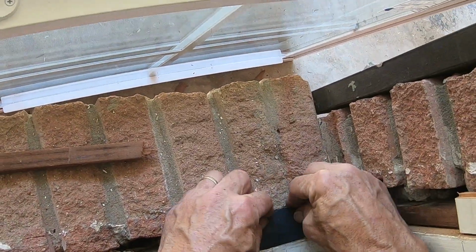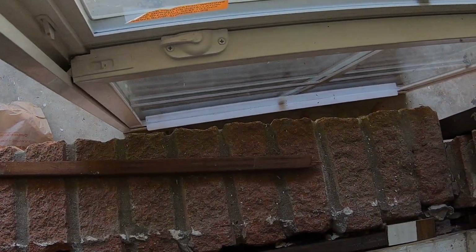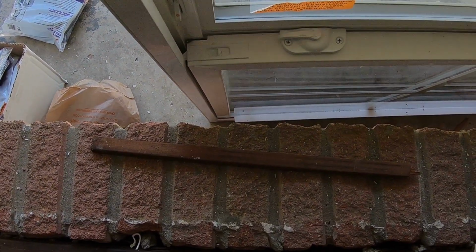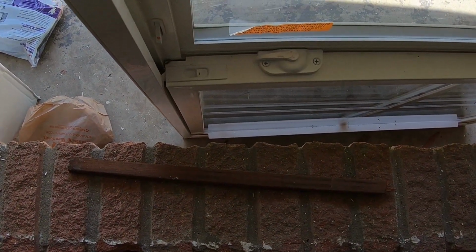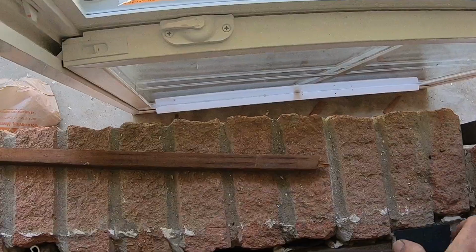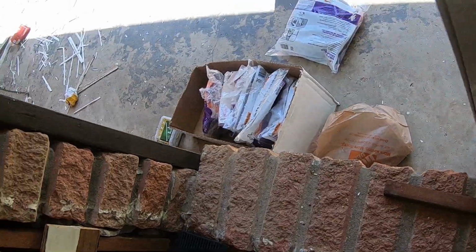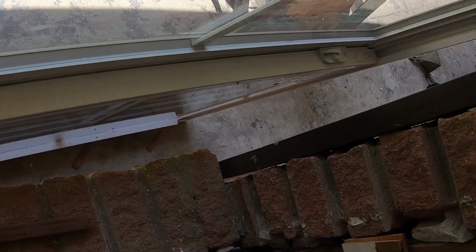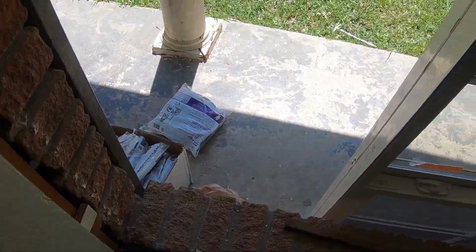Figure out. Okay. And these spacers, of course, I broke them, but anyway, they're wedged. They go from big to skinny, and if you put one with the fat end this way and you slide them together, the more you slide it, the thicker it gets. So I'm gonna put it like this. Now I'm kind of flush with that, and over here I'm flush with that. Slide it all the way up in my corner. All right, let's try that. See if that works.